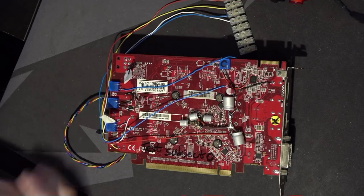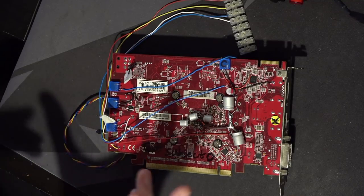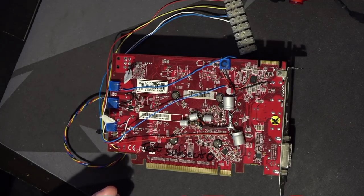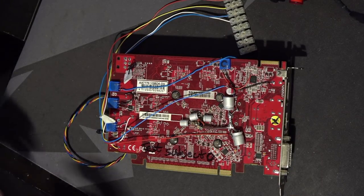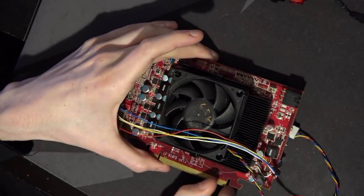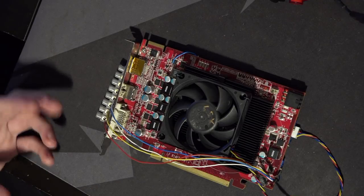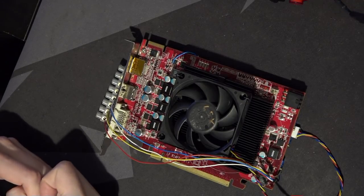The thing is, on some rails I'd assume the capacitors I'm using are too big, or I just didn't add enough capacitance. The capacitors aren't low enough ESR and ESL — or rather, I didn't add enough capacitors in parallel to make much of a difference. I was very strongly considering adding capacitors straight to the actual substrate of the GPU core, but I couldn't do that because I only have 0402s, and those are way too tall — if I put a 0402 onto the substrate, the heatsink wouldn't make contact anymore.